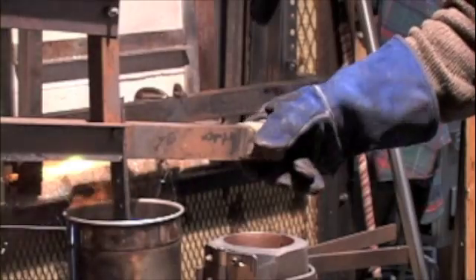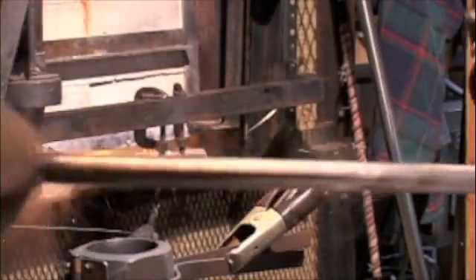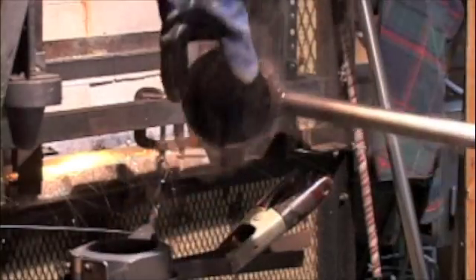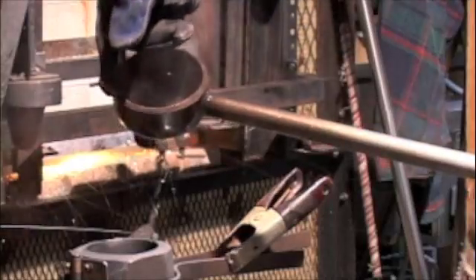The plunger needs to be cooled after every pressing. Now I'll demonstrate the pouring method that produces that V-groove straw line on the insulator. I'll be gathering this way, and there'll be a stream stuck to this side of the ladle, and I'll pour that into the mold.